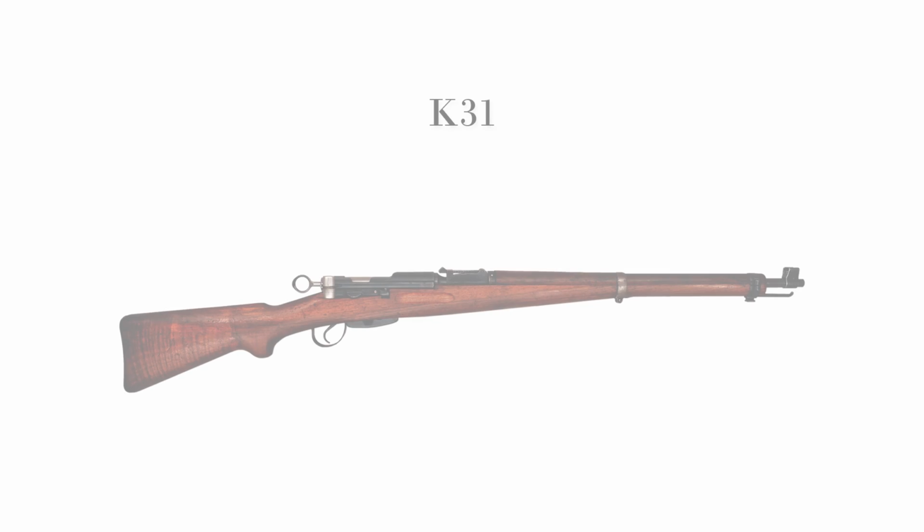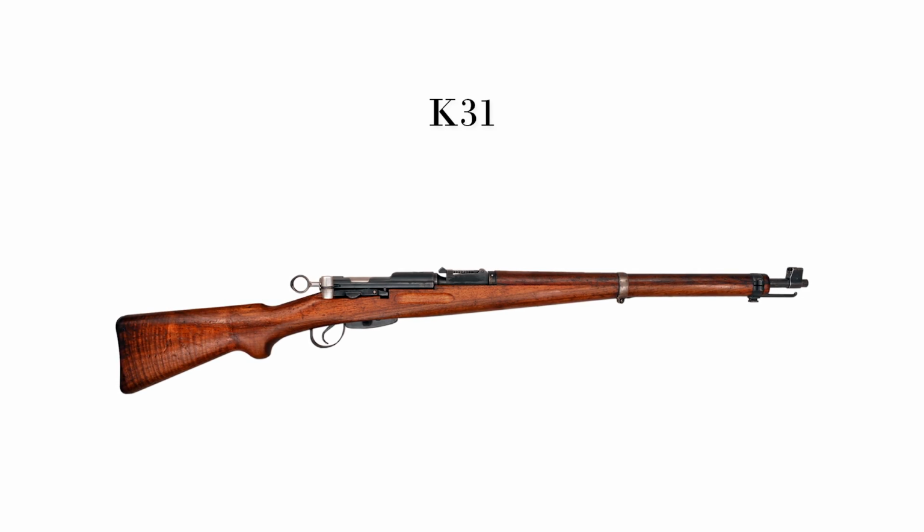The only problems I have with this gun are inefficiencies in design that ultimately we see, and we're not doing this episode, but I'll give you a little bit of future speak. If you've ever seen the later 1930s K-31. I love the K-31. And what they did with the K-31 is they nested the bolt body into the unlocking mechanism. Because right now that bolt is twice as long as it needs to be. Oh, yeah. And so just imagine this going here. Right, so that's a mechanical inefficiency because essentially what they've done is they've built a bolt and then put the Vetterli bolt on the front of it, you know? And that's just how they had to do it from their understanding coming from the Vetterli.